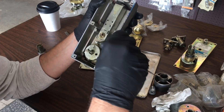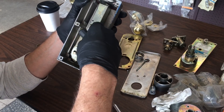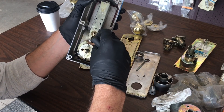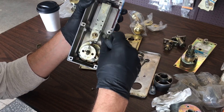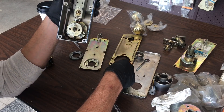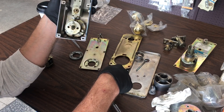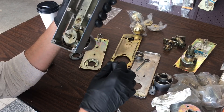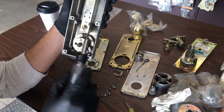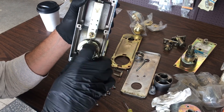Another thing that's really important is to remember how these legs work. Because once you take these legs off, you have to put them back on and they swivel. So if you just remember the copper one, which is on the bottom, goes down — or take a picture of it. Because you can put it back on incorrectly and it's not going to work right. When you take that off, it's a good idea to set it down somewhere where it won't be disturbed, just like it was. Once that's off, you take these two screws out to get your combo chamber off.